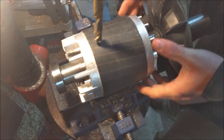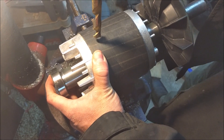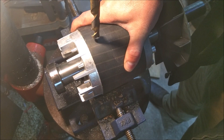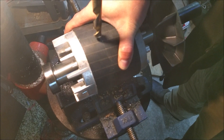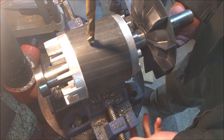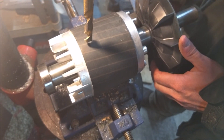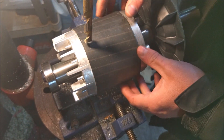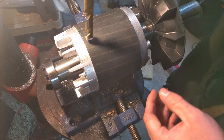Something to keep in mind: these rotors are made out of very thin laminations. Whenever they start cutting, they cut pretty fast and sloppy — just something to be prepared for. In the spirit of things, I'm even going to eyeball it. I'm using a drill press that has a gauge on the side telling me how far down I've bored.